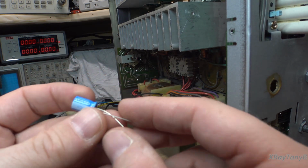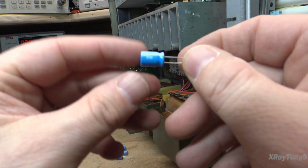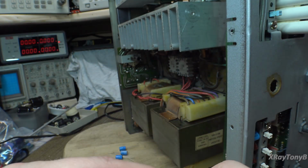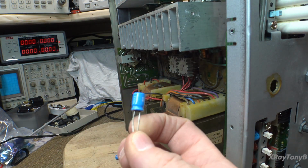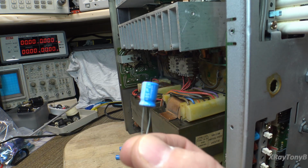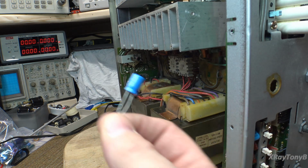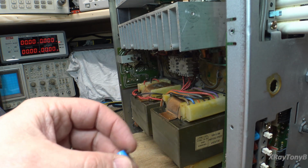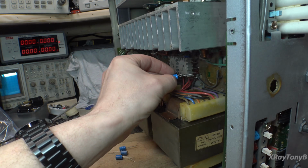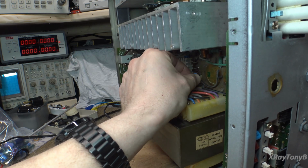Okay, I have just 4 of these left in stock. They're Nichicon. They're 47 microfarad at 50 volt, just like the old ones, but they are rated at 125 degrees C. They are really high temperature, very durable. These are automotive grade capacitors. They're designed to be put in very high temperature environments. And I've noticed that when you use these in the power supply around places like that, right up against a heat sink or something, they tend to hold up much better than just a standard cap. So we'll put those in, and I'll have to order some more next time I place an order.